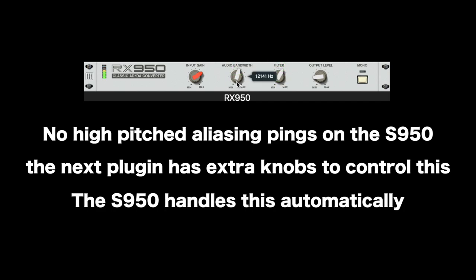The big thing with the S950 was it only ever came with, I think it was 2 meg of memory. So the reason why you brought your audio bandwidth down was to save memory. So if you're sampling something at 10 kilohertz, it's half as much memory as sampling at 20. You're sampling half as many things in the same amount of time. And what that does is this. The output, try and get them level. There's the grit. This is why people love it. So you still got the hi-hats in there, you still got the groove. You lose a lot of information, but you sort of gain stuff as well, an awful lot. Very nice. €17. I just bought it because it was an absolute no-brainer.